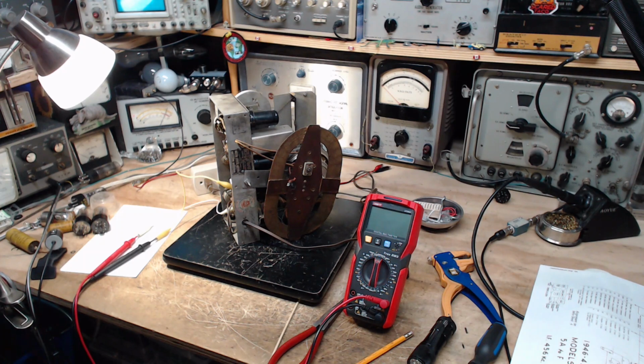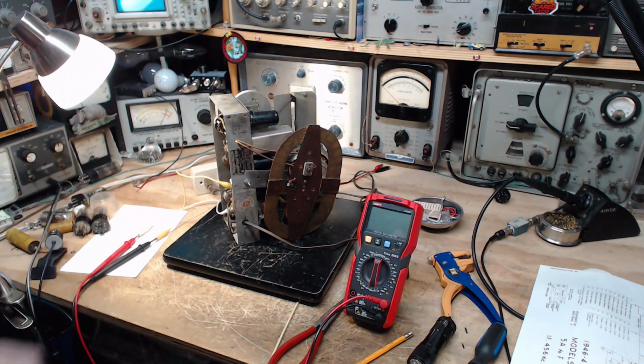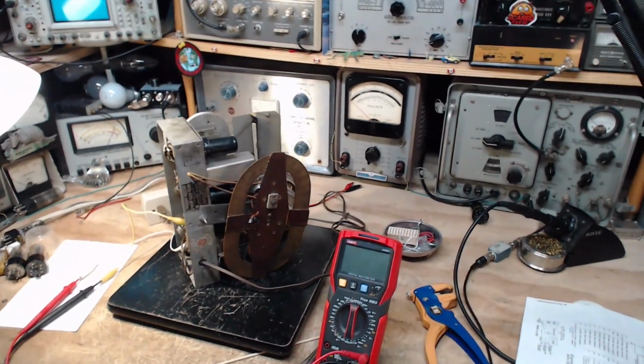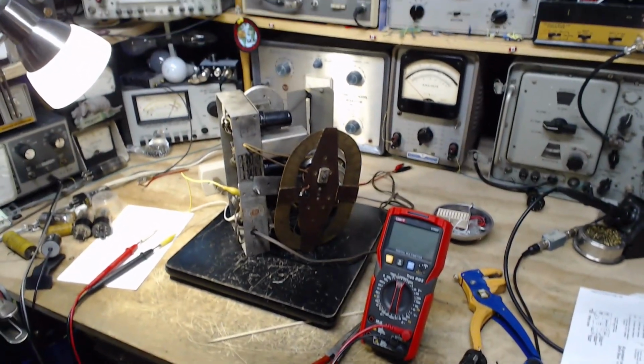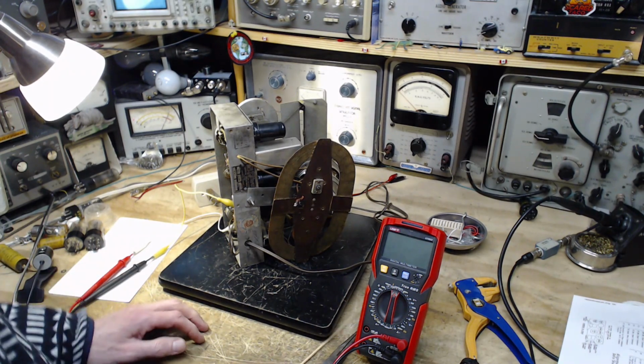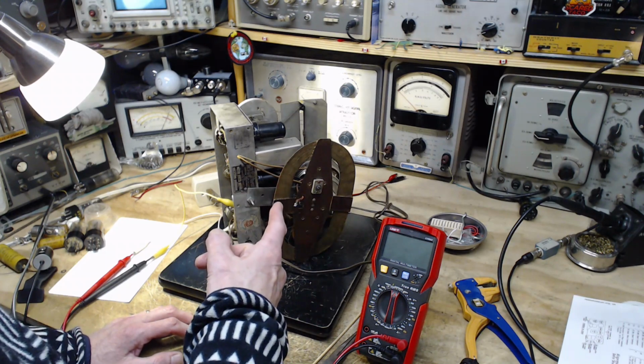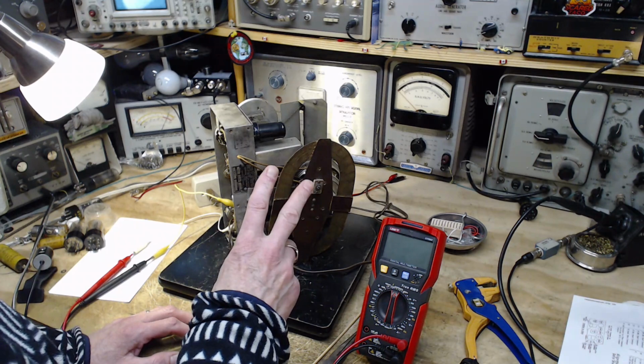It's March 1st, and just when I thought the rectifier tube situation with this radio couldn't get any weirder, yeah, it can get even weirder. So what am I talking about? If you've been watching the videos, you know I've been hunting down the cause of low B+, and somehow it went away. The low B+ went away. I'm really not exactly sure why. It would appear that a bad tube in the radio was substituted with another bad tube in the radio.